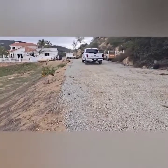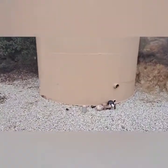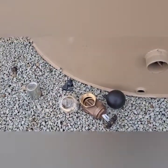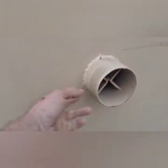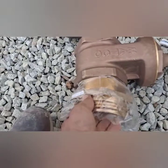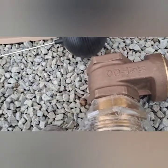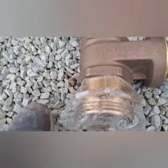There goes the crew. Let me point out a couple things. This is the main fire connection here—that's why it's four inch, it's huge. This is going to thread directly onto the tank, which is welded with the correct bung and the right thread. This right here is the standard fire connection—really the same as a fire hydrant. This tank basically serves the purpose of a fire hydrant with 5,000 gallons.